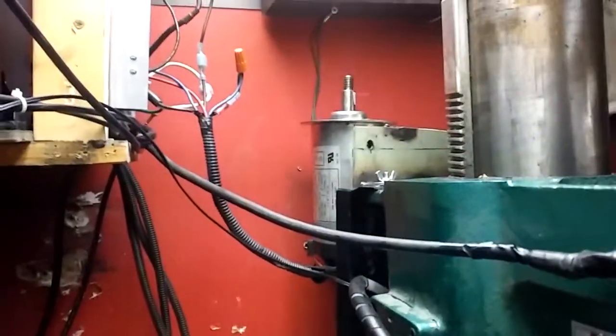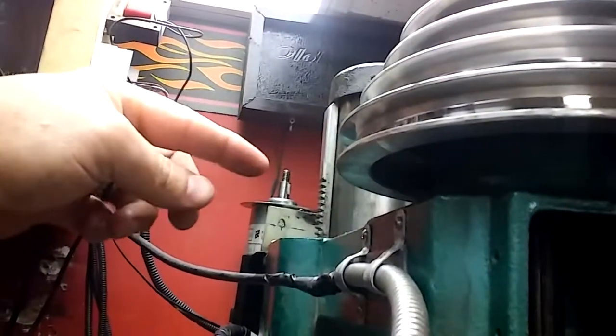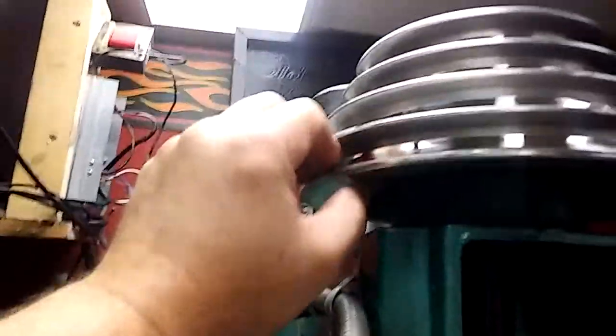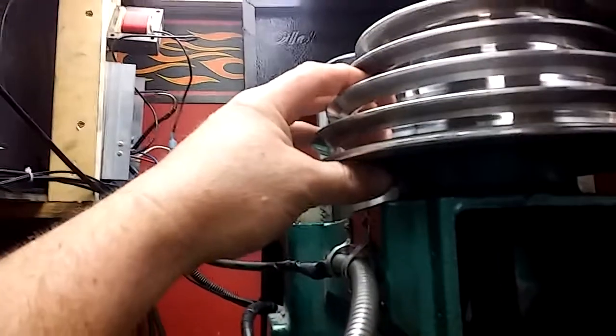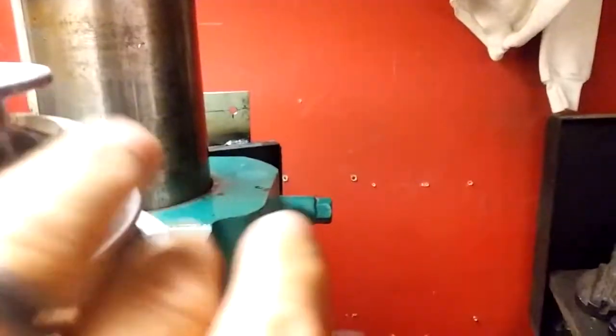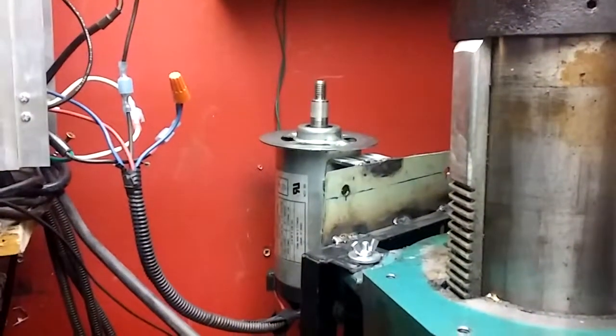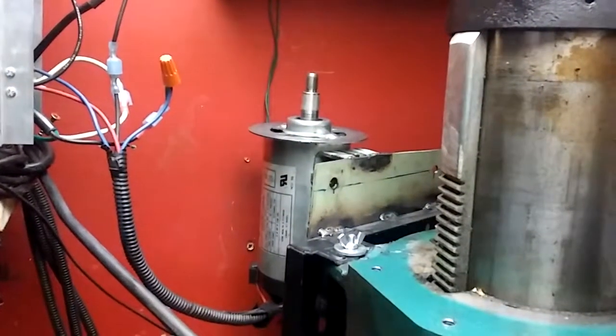I mean, obviously appearance really doesn't matter for results, but another thing that I did here, again, it don't matter. Another thing that I did is I'm looking for the pulley, and I'll do the necessary machining. I figured out 1-to-1 is plenty good for me as far as spindle RPM. This one right here is a 6-inch pulley, 7-inch OD. I figured if I get a 7-inch OD pulley, I'll be able to straddle this column. I've already taken out the idler pulley. I wanted to do away with that, but I feasibly got the treadmill motor mounted.